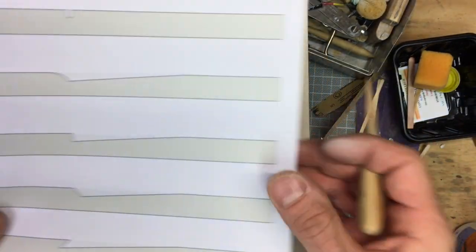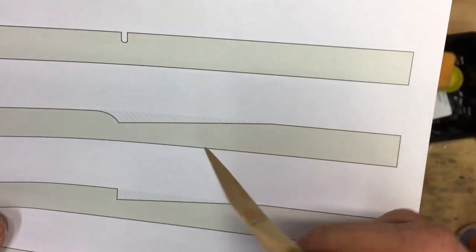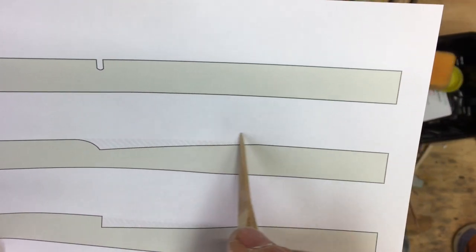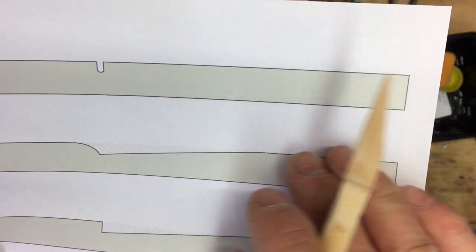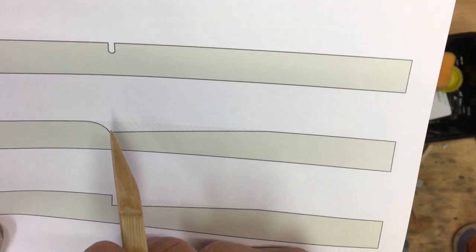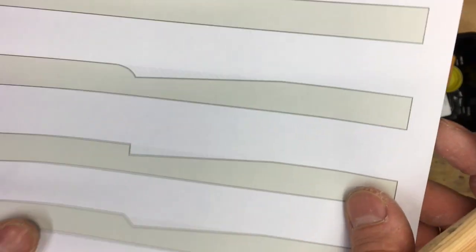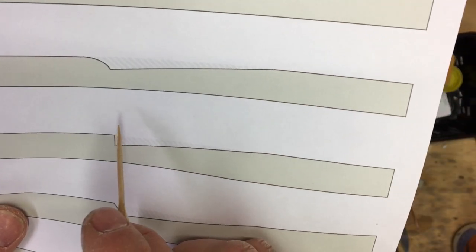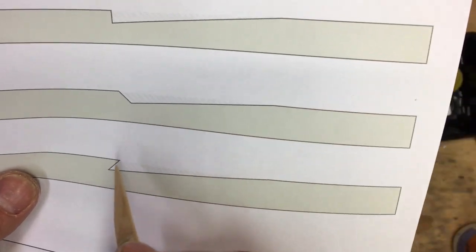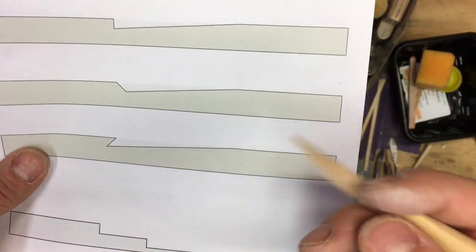Now, that's not a relief carving. Relief carvings are made up of very shallow sculptured reliefs. So imagine if on one side of this divot I removed a bunch of that material, but I removed it in a way that faded it up into the side. Now I'm going to use a technique similar to this. That creates, especially with the rounded edge on one side, a really gradual shadow effect. If you use something that's a little bit more abrupt, a sharp facing corner, that throws a little bit harder shadow. Something that is undercut underneath throws a very, very dark shadow. I'll do some examples in my carving here in a minute to give you an idea.